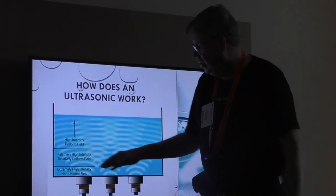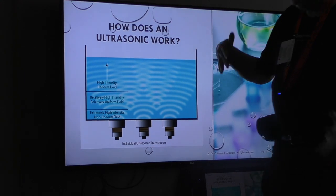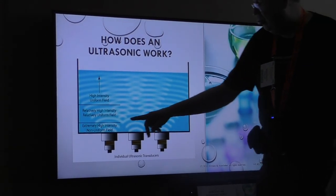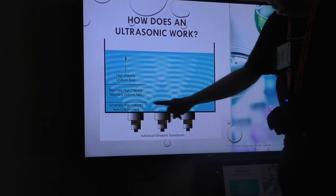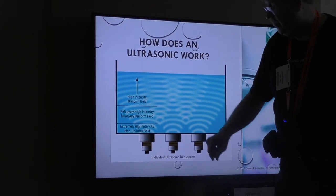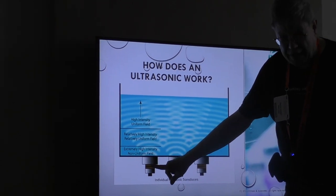Start. There we go. So here's an ultrasonic tank, stainless steel, typically. And, you know, they're rated 4 liters, 8 liters, 6 liters, which is 1.78 gallons, whatever. Underneath we have basically speakers or transducers. Now, these transducers are audio, basically. They're coupled to the base of the stainless steel, and nowadays they call them ceramic transducers, and they generate an ultrasonic signal, sound, 25 kilohertz, or 30 kilohertz, or 35 kilohertz, or 40, or 60, or 120, or 100,000.